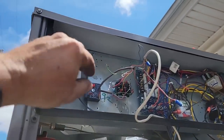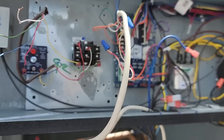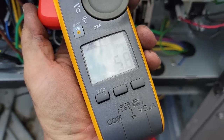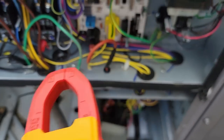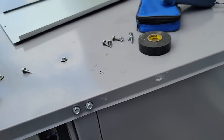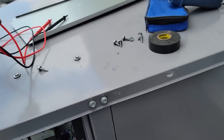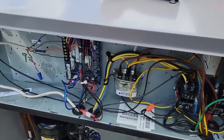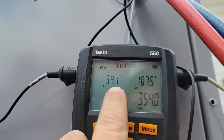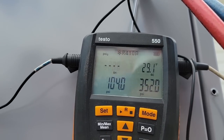I'm just going to reuse it and add whatever we need to add to it and kind of go from there. Everything else is looking pretty good. Right now I pretty much got this disconnected, got wires back to the way they were. I think I'm going to go one more turn on my fan yet. So 5.8 is our highest leg on the motor, which we had room up to 8.8. Pre-check the RPM — we're right about 900. The wiring I cleaned up, got rid of some of this other stuff.